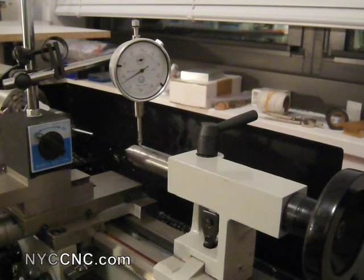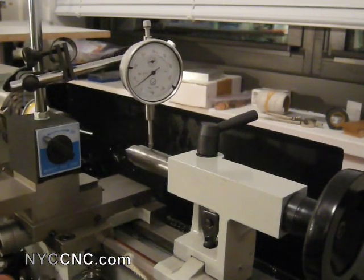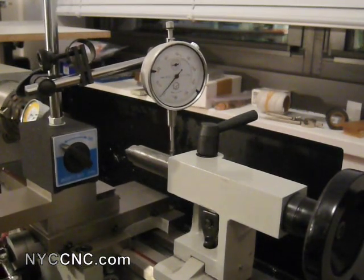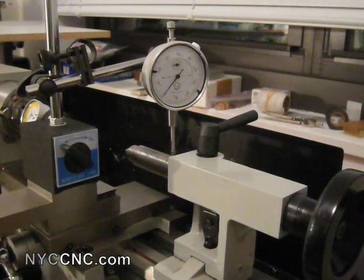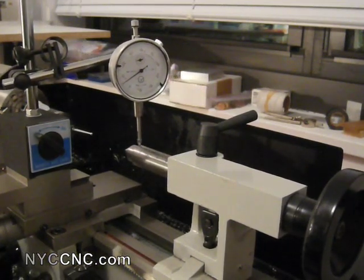But nevertheless, certainly a good measurement to run. Just to finish it up here, I'll check if I run it all the way back and end up at my starting point. Actually, of interest, I'm about a half a thou high, so I'm going to go ahead and run it back, just curious to see how my markings hold. The same point there, just a hair under six thou.